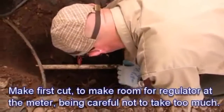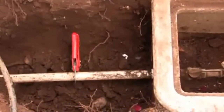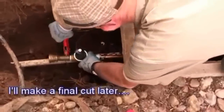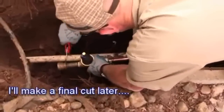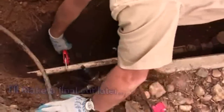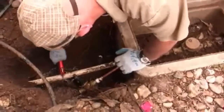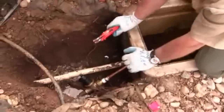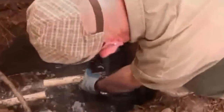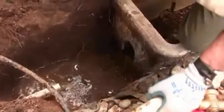I'm just going to get this pipe out of my way right now, so I'm going to make a random cut so I can start working in between where that cutter is and the house valve — the first valve after the meter. There are two shutoff valves in that meter box. There's some water coming back, but it's minimal because this meter box where I'm working is not 20 feet in elevation below the house. That would be a problem — you'd get more water down into your hole and you'd have to pump it out or bail it out.